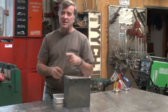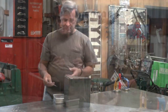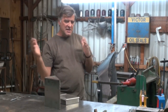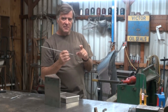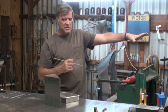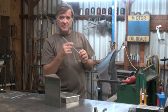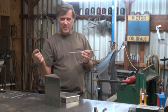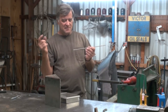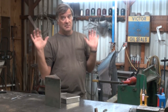Out in the wind, the wind does not bother stick welding at all. The wind will bother the TIG welder with the shielding gas because it'll blow the gas away and then you get a bad weld. So that TIG welder is really a great combination — you've got the high end, neat, and clean. As long as you have the correct kind of filler rod for the TIG and the correct kind of gas — normally argon, sometimes a different gas depending on what you're working on — you've got neat, clean, precise on that end of the scale. You get different diameters of filler rod or sticks for your arc welder, different types of metal for different kinds of metal that you're welding. That gives you the low end — the quick and dirty, the outdoors. Heck, they even use this stuff underwater. I don't even want to get into that.